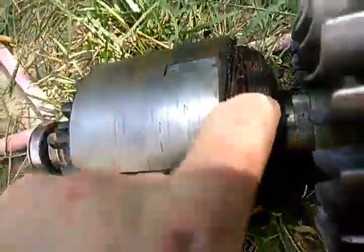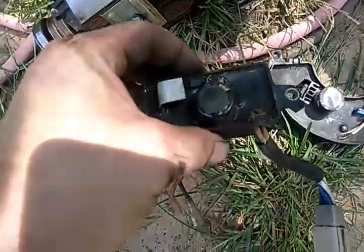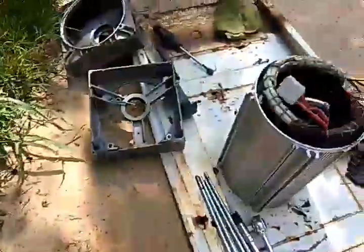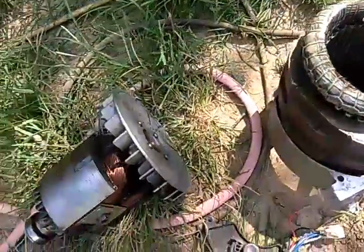I've got a dead short in it, and if you look right here, there's the problem. We're grounding out here and I'm not building up a field on here with my AVR. It actually caused issues with the automatic voltage regulator in brushed alternators or brushed generators. This is a self-excited generator and this is a brushed generator.